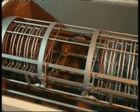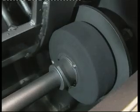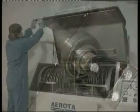On a weekly basis, the drum should be removed from the cabinet and the opportunity taken to check the shot for contamination, and to check that the drum drive rollers, idler bearings, and lid seal are intact.